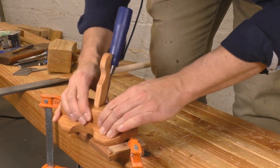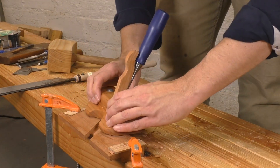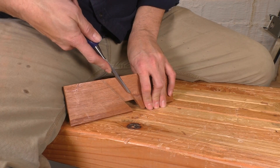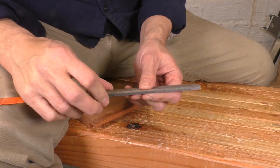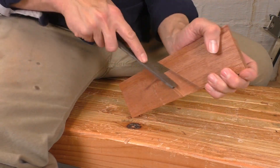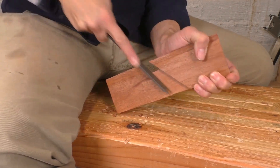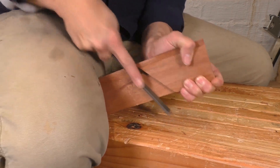This is going to be a laminated plane, like my previous builds, so we want to get this recess as perfect as possible while we still have easy access. I'll give the walls a light paring, and I can also use the side of my chisel as a straight edge to make sure my walls are actually true. Another excellent tool for plane making is a regular old file — the one I'm using here is a Nicholson Handy file. It's got a built-in handle, different teeth on each face, and one edge is ground safe, which means it has no teeth. Put that safe edge toward the inside while you're filing the walls, and the file won't cut that nice surface we just made with the router plane. I'll throw a link to this tool down in the description.